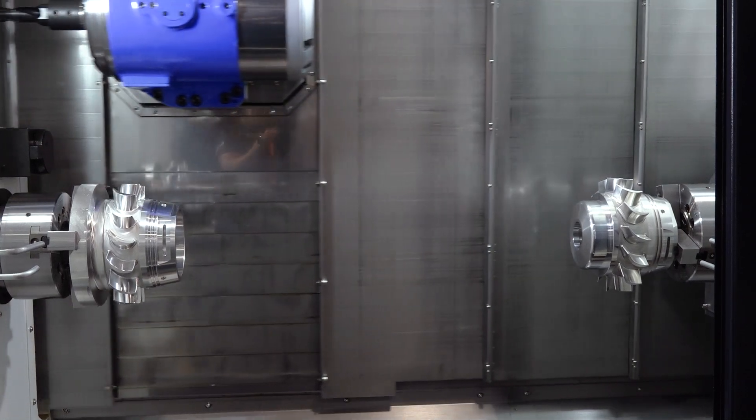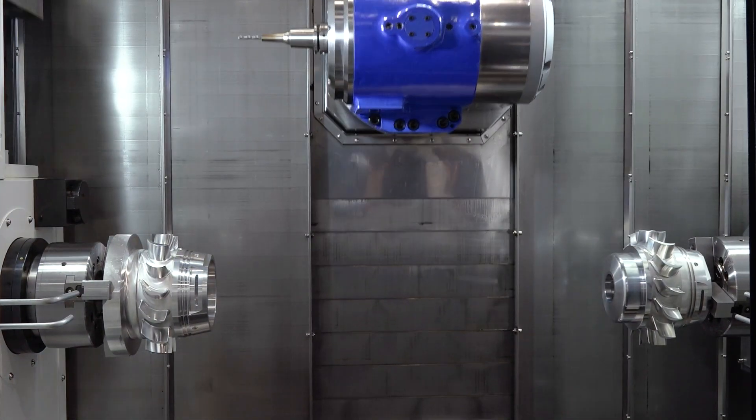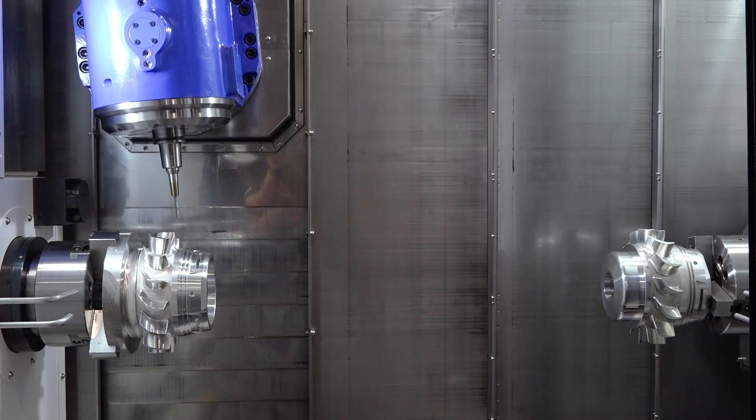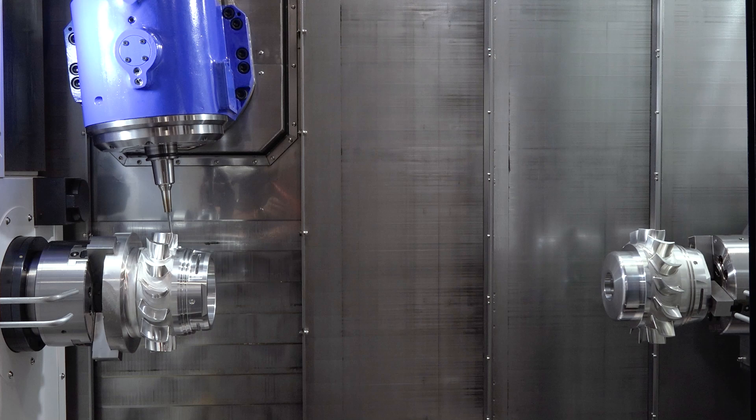These are eight-inch chuck matched spindles — true integral motored spindles with the B-axis head for flexibility. Right now we have matched spindles, but later we can add a tailstock or a lower turret. We're putting raw material into the main spindle and spindle two handles the second op. We use a roller-type design, not a worm gear, so it's a roller-type B-axis head giving you zero backlash — super precision.